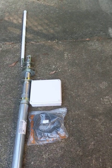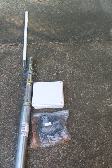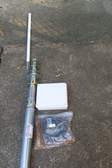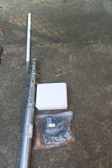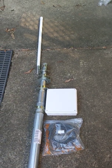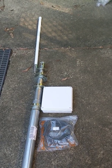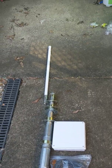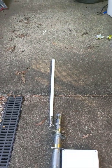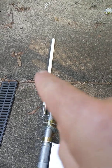For a length that long you could use CAT6, but CAT6 is generally not rated for outdoor use and is more prone to receiving interference on the line. I'm trying to minimize as much interference as I can and produce the maximum gain for transmitting and receiving out of my antenna at the top.